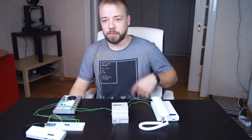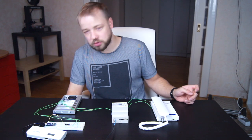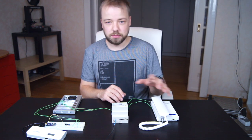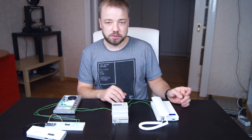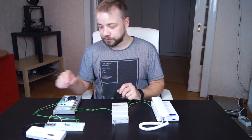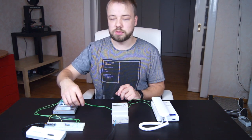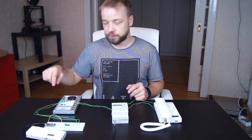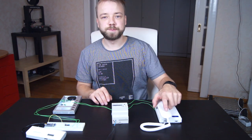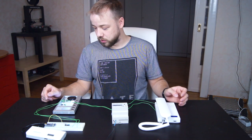Today I want to talk a little bit about this intercom system from the company TCS, which stands for Door Control Systems. I am installing these systems at the company where I work, and I often ask myself how it works in the background and what protocol is used, because the whole system runs with two wires where the power is also distributed to the different devices. If, for example, someone presses the bell button, the telephone then rings. And I was asking myself what the whole system is doing behind the scenes.